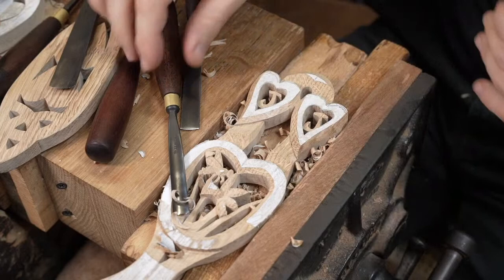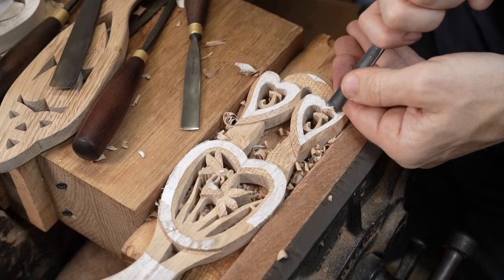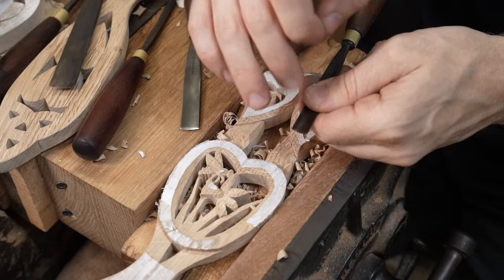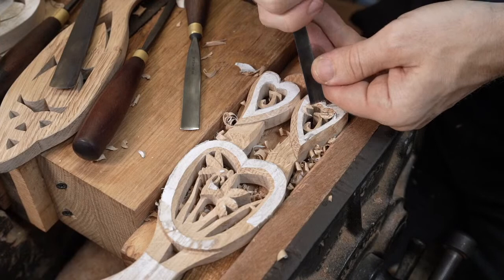Yeah, with the Tormek, you've got the three parts to it. You've got the whetstone, you've got the honing wheels, and you've got the stropping wheels. So we're basically sharpening on the external angle. So use the stone to sharpen on the external angle. You get a little burr on the inside, so use the honing wheels to take off the burr. And then Tormek sell a honing paste. And so you put a little bit of the honing paste and then polish the metal. So it's a sort of three-part system with the Tormek.